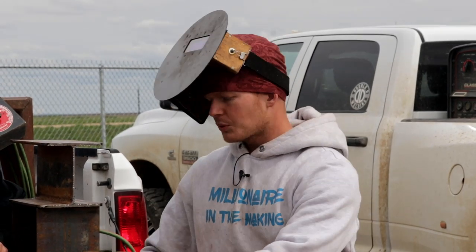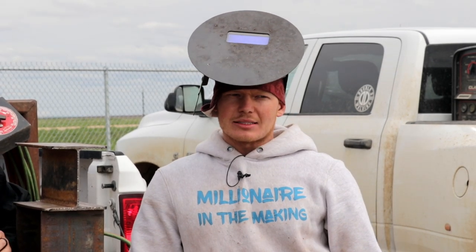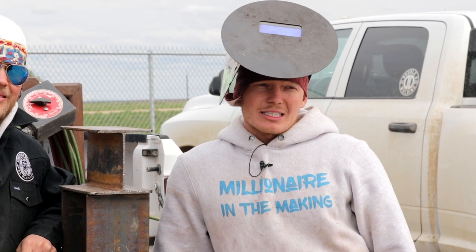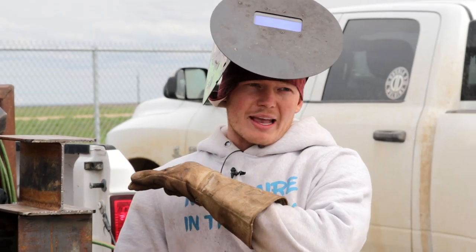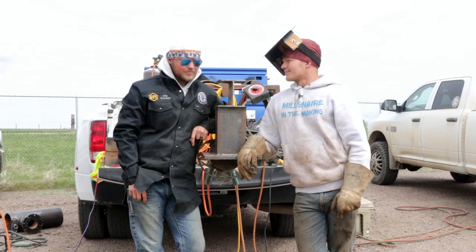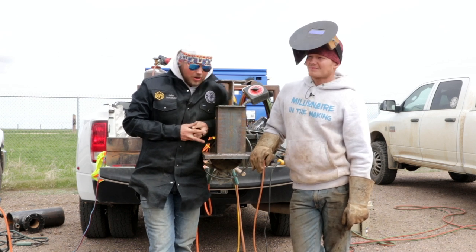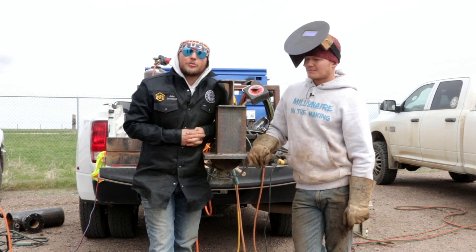So what we just got through doing is showing everybody how I weld on my structural supports. The last thing I would add is the one thing you guys didn't get to see me do is prepare my pieces. You know the old Abraham Lincoln saying — if you gave me nine minutes to chop down a tree, I'd spend the first seven sharpening my axe. That's what I'd recommend for anybody in this line of work. Make sure you spend that first time getting straight cuts, make sure everything's square, and it goes together a lot easier. This all comes with preparation — everything you're going to do is all preparation. With the root pass being 6010, just make sure it's all in your procedures and always follow your procedures.